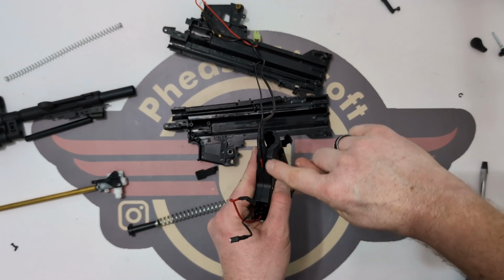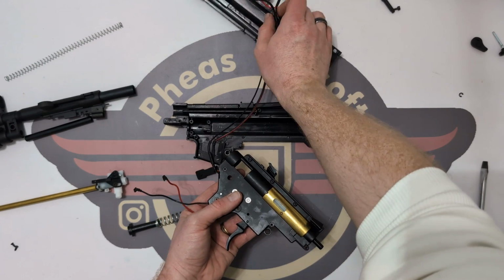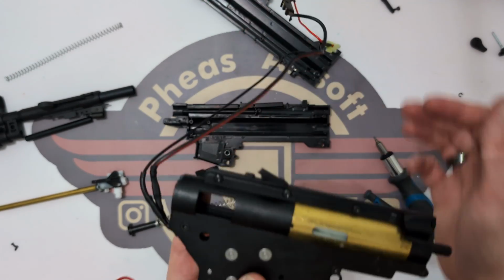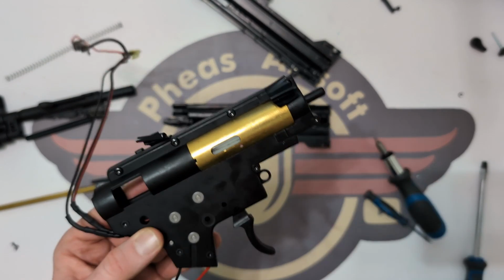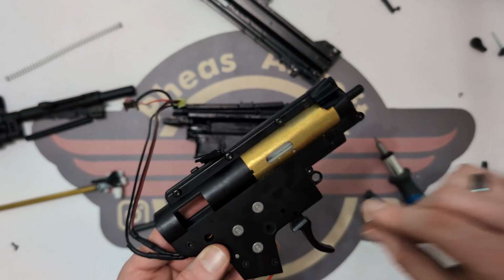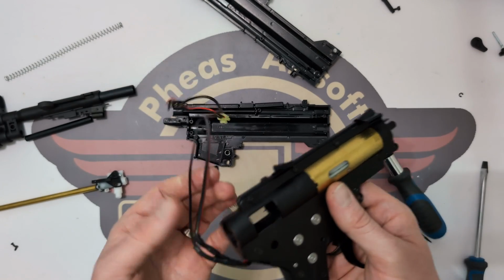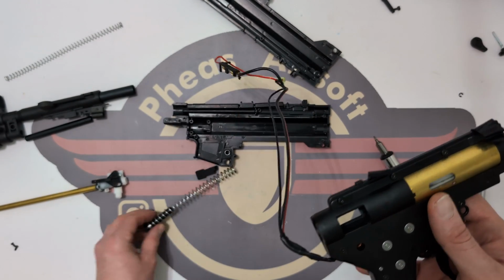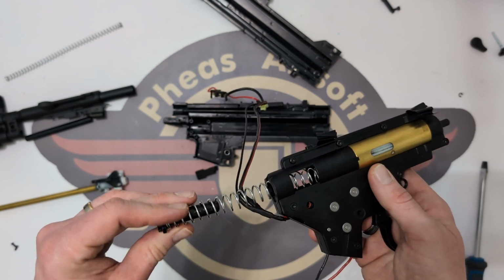Make sure that the gearbox is all flush all along the seam, the two halves of it. I am throwing stuff all over the place there. Lift that out of the way. So you're making sure it's flush. Make sure that the screws go in easily until the point at which they sort of bite down for that final bit of tightness. If at any point you're fighting it all the way in, then it's not in the right threads and you're damaging it.